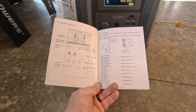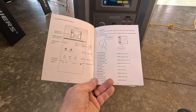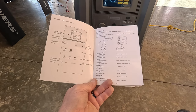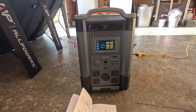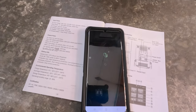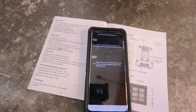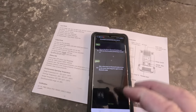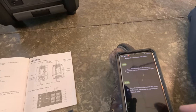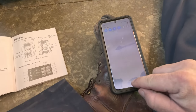The voice commands are neat but I'm not sure they're needed — I'd rather use the Wi-Fi because it gives you more range anywhere Wi-Fi is available. Bluetooth is going to be around a 30-foot range. They've got the same app for both. In the All Powers app you go to Bluetooth — step one: turn on the phone's Bluetooth, short press the Bluetooth button, turn on the screen, long press again to enter Bluetooth mode. I did not have much luck with this.